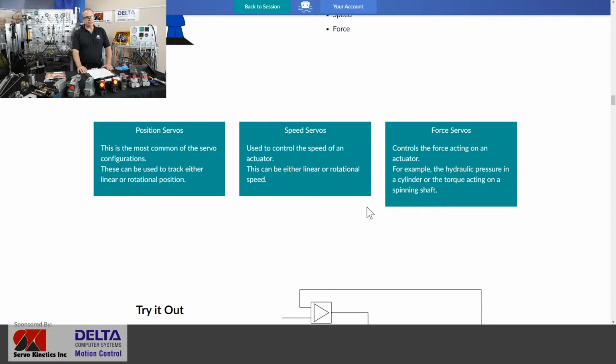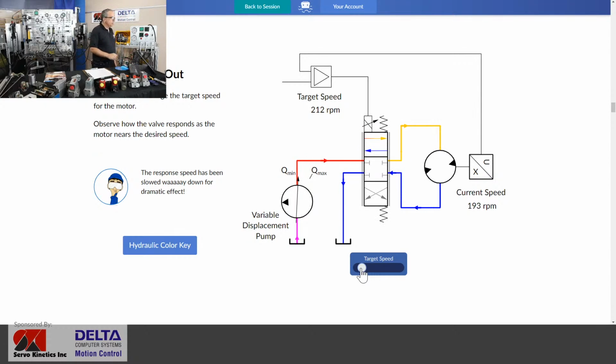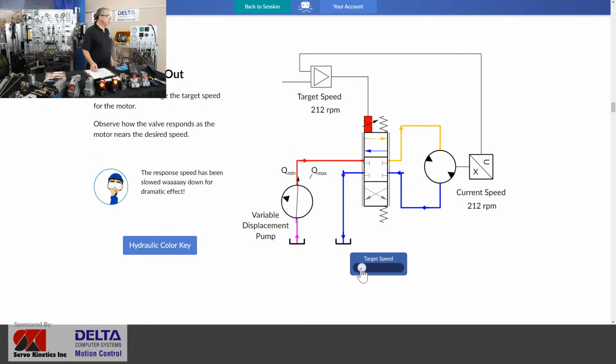Very little motion taking place, just enough to either set the nip between rolls or to produce a crown shape on a paper machine roll. And those rams are actually then inside a paper machine roll, and very careful pressure servo controlling is being done. Here's an example of speed control where our motor becomes active and produces a speed. And then obviously our transducer in this case is not a displacement transducer. We need some kind of a speed sensor measuring the RPMs of that hydraulic motor and then using that as the feedback signal instead of cylinder position.